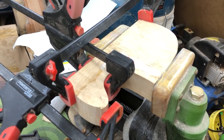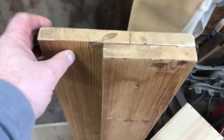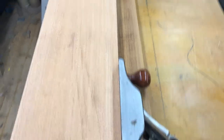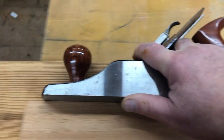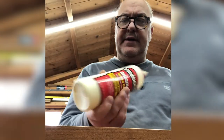The next job is to make the back of the guitar out of mahogany. You've just got to take those two pieces and match them - it's probably about four millimeters thick at the moment. I've done the joint, which means making this absolutely flat and true. It's done by planing using a shooting board: put the two pieces together in a butterfly so the up faces are inwards, get a really sharp plane, lay it on its side on the shooting board, run it up the side, and get that perfect right angle and joint.